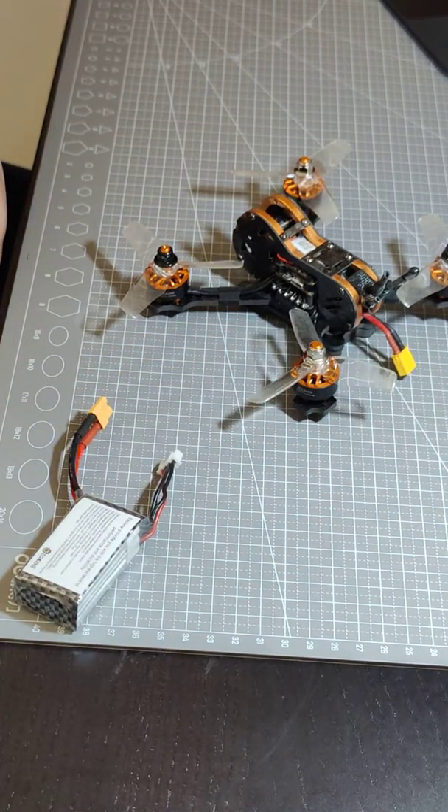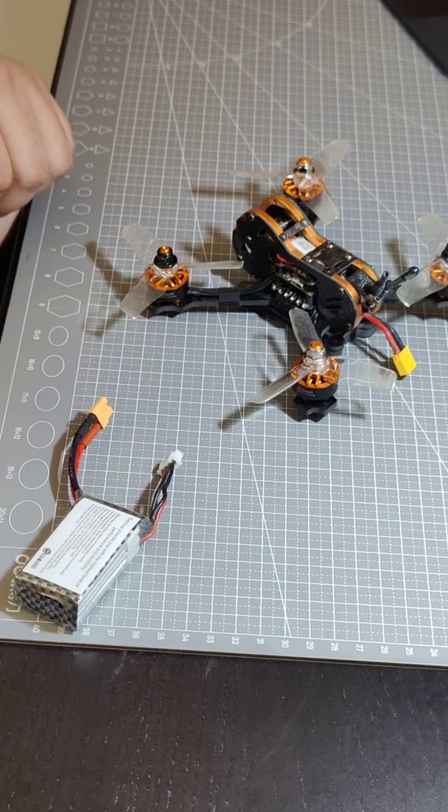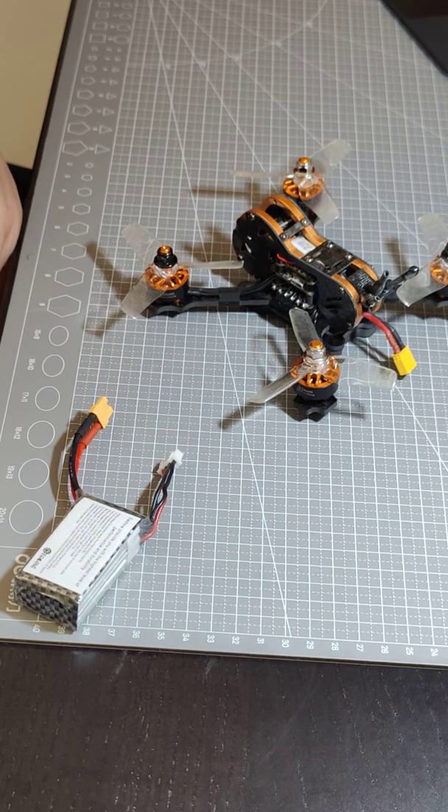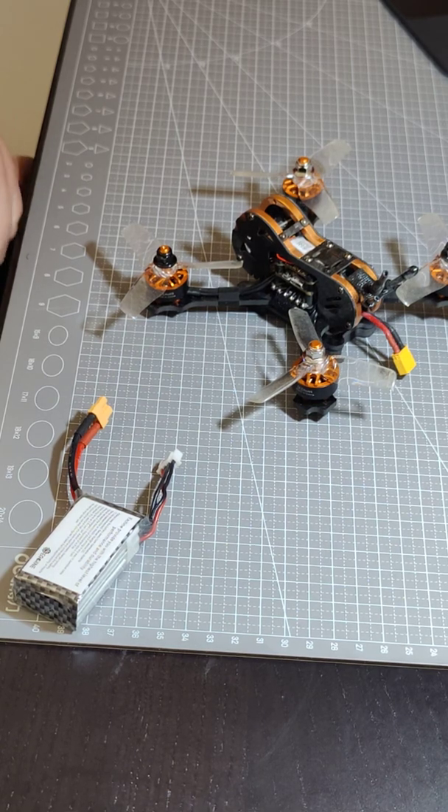So I tried using that and I found a manual for the Tiro 79 on the Banggood website and I tried to follow it, but the first problem I ran into was that the manual mentioned the Tiro 79 VTX should have three LEDs — green, green, and blue — whereas mine only has two. After quite a lot more searching, spending a couple of hours, I was able to find another manual for a more up-to-date version of the VTX which mentions only two LEDs and explains how they indicate status and allow configuration. I'll put a link to both manuals in the video description.